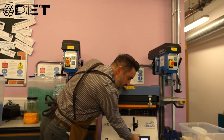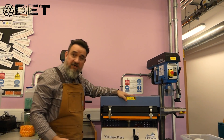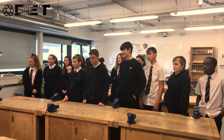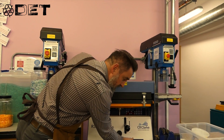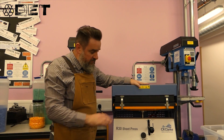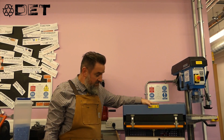We can set both of these plates independently to our different range of temperatures — from around 100 degrees up to about 220 degrees. Now depending on the type of plastic, you would obviously set it differently. HDPE has a melting point between about 130 and 140 degrees. We've picked it up a little bit and we're going to put it in at 160 degrees and bake it for 10 minutes.